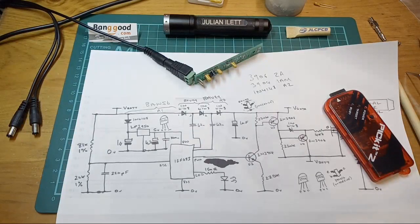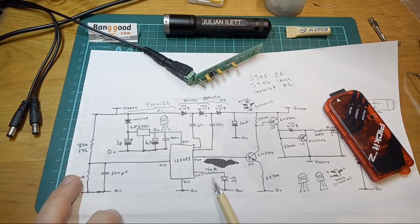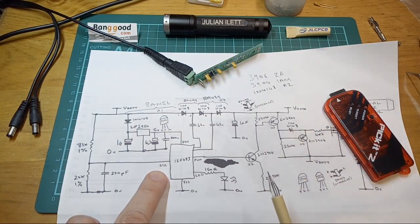It would be easy to put open jumpers that you could put a solder blob on after programming. Yes, I mean, actually, may not even be necessary, because you could, of course, leave these two components out, the 20K and the 220 pF, and you could leave out that 150 ohm resistor. And that, of course, would isolate these two pins for programming. But then the question is, maybe in the future I release another version of firmware. Forget it, ain't gonna happen.